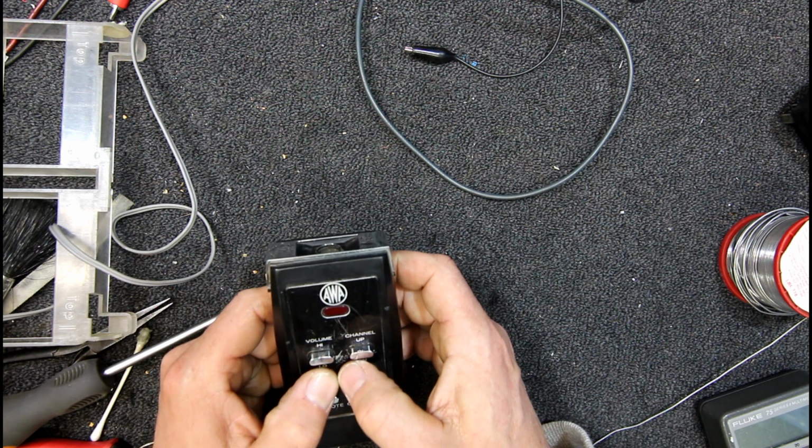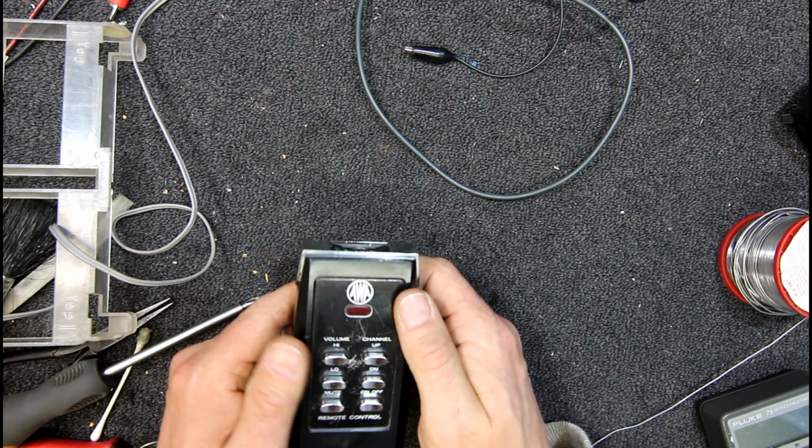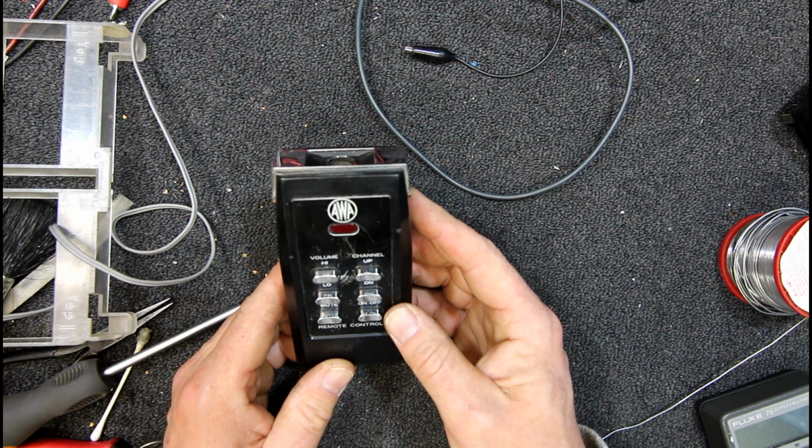Yeah, now that you look at it, you kind of realise that is a little baby neon. So I wonder if they're a lower strike voltage, but still, it's got a 470k resistor. They're dropping a hell of a lot of something to it.